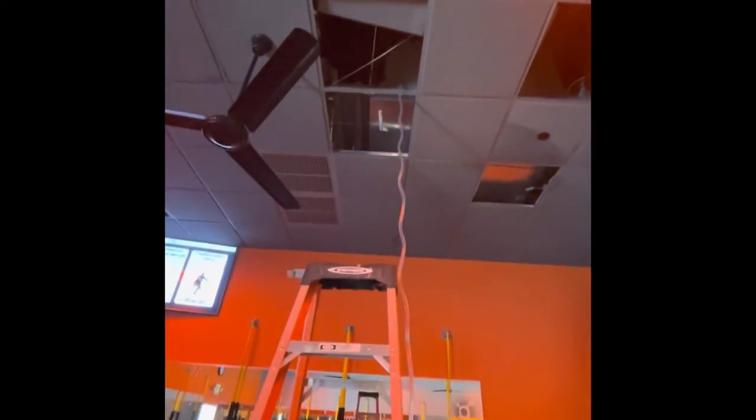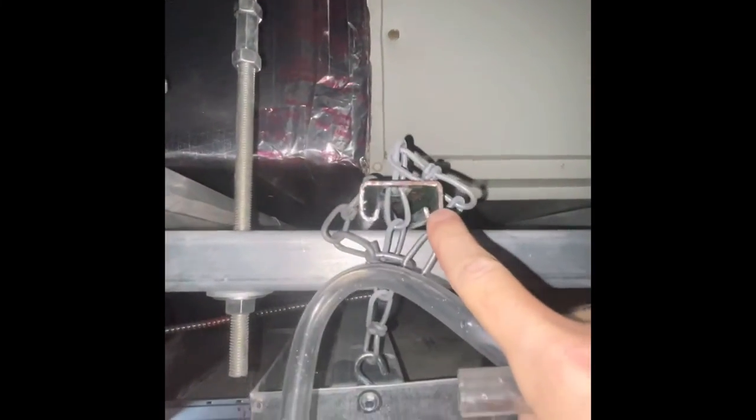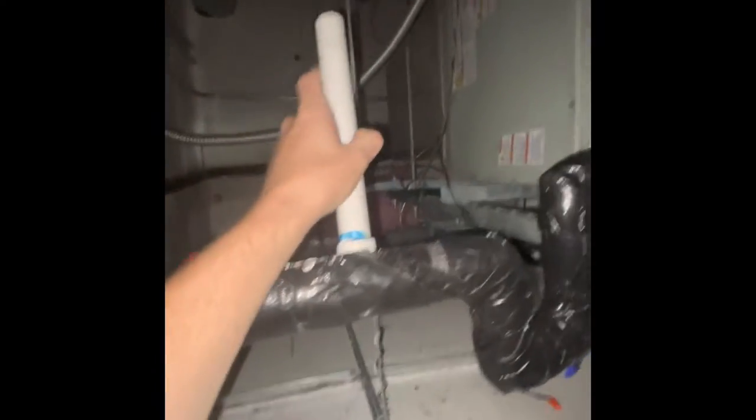Now we're doing this side of the pan. The whole pan is being hung up by a bracket like that — that's how it's holding the pan up. So you have a seven-and-a-half-ton package unit, and right here you have this three-quarter-inch drain going into another seven-and-a-half-ton package unit which is also three-quarter — way too tiny. So we hold the trap to vacuum it.